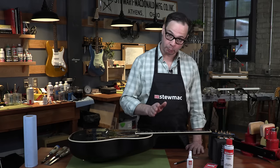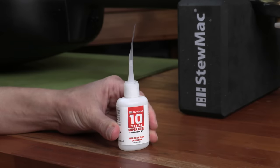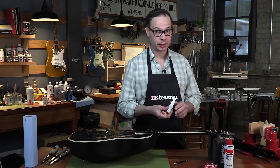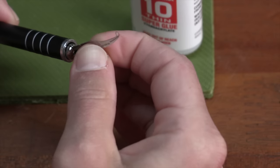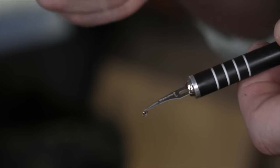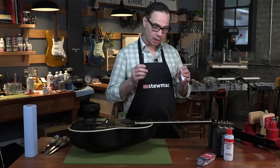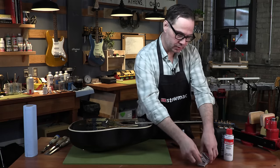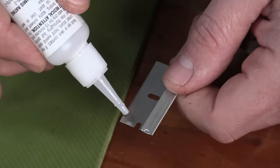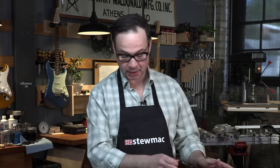So we have some things that will help you be neater with this glue. They come with these whip tips which are great for precise application, though you do have to be careful — I'm always leery about taking a full bottle of super glue and turning it upside down over my guitar. We also have things like the glue looper; you can put this in an exacto knife, which will allow you precision application drop by drop. These are great for drop fills on finish, filling cracks. But my preferred method of application is just the single edge razor blade. These are cheap, they're easy to find. You can apply drop by drop and you can't spill any more super glue than what you put on the blade — it's a lot safer than turning the bottle upside down.